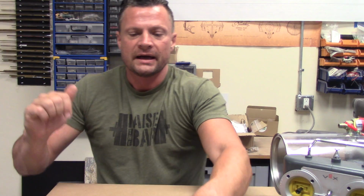The only thing that may give some people cause to pause is the fact that if there is a grievous operator error in that they open that equalization valve while submerged, you're going to suck water into that ballast pump module and you're going to partially flood it. Not a good thing, but the way I've gotten around that, I have isolated the control for that equalization valve on a completely different control. You have to make an intentional decision to activate it. And if you happen to do that in error, you were not thinking, and maybe sinking your model will teach you not to do it next time.